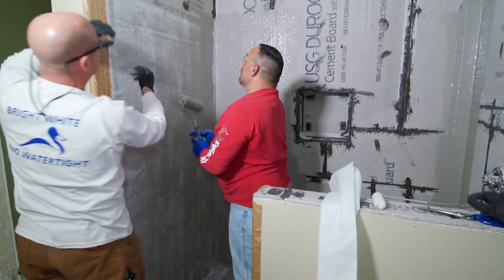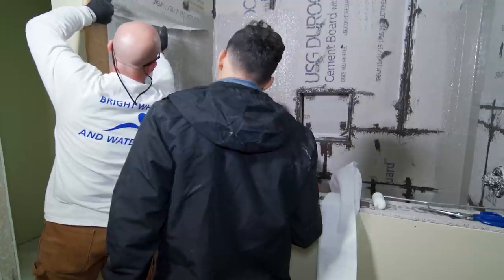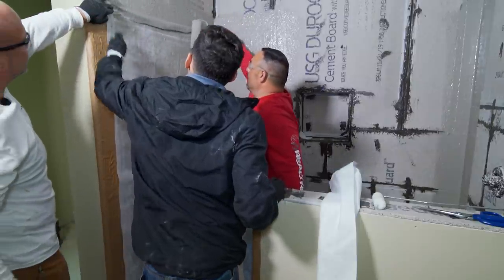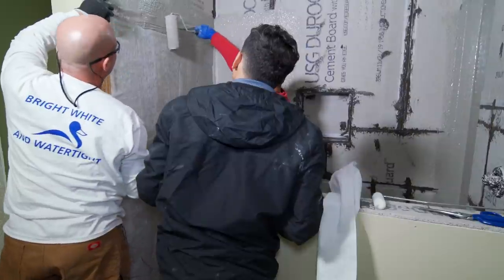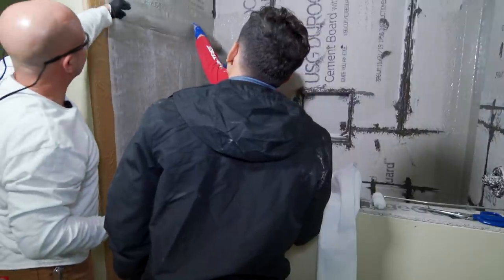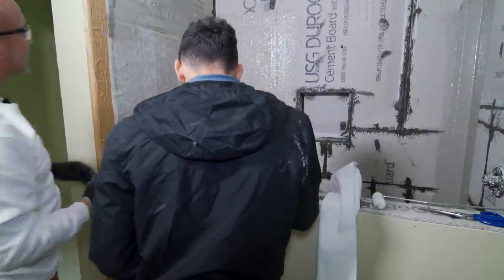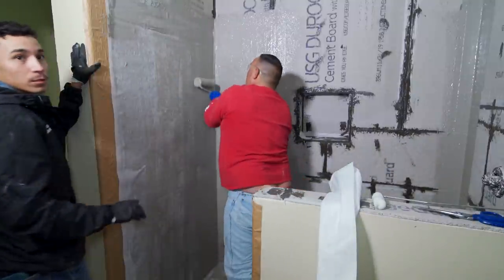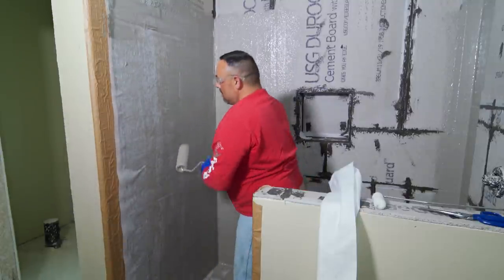Do you see how you don't see liquid above this area? If he's hauling, you need to help him see that he needs to apply more. He's going to paint one time right across it on the fleece. See how it's all white right back there? Now you're only going up that high, so drop that roller down. He's going to have adhesion on that top side. When he comes down, how many inches should he go over this piece? Two — that's right. Two inches minimum. If this ever creeps and it goes to one and three-quarter, don't let it creep — two inches is your minimum. A lot of the guys in the field will make adjustments; you can go two and a half, three, whatever — just keep it at least two inches.